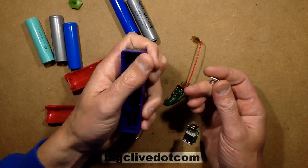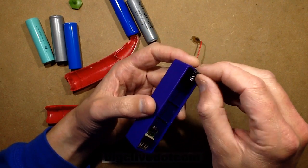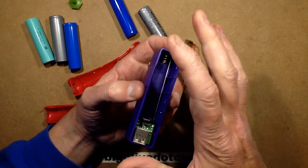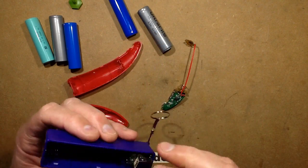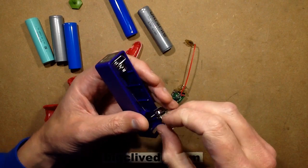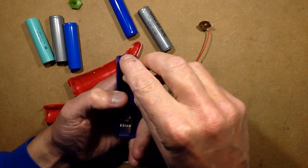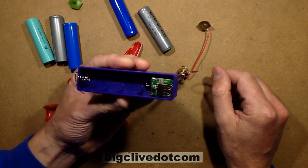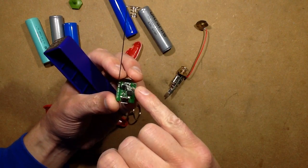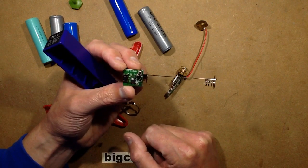This other one is out of a Pound World power bank — I haven't had much luck with these. You don't get much for a pound: I got two of them in a fetching purple colour, and one had a completely dead lithium cell — zero volts, definitely a bin job. The other one, as soon as I put my meter in series to check its quiescent current, it blew the fuse in the meter and then started getting very hot because the chip had died instantly. It seems there's a serious problem with some of these Pound World power supplies where the chip doesn't take much to go thermonuclear.